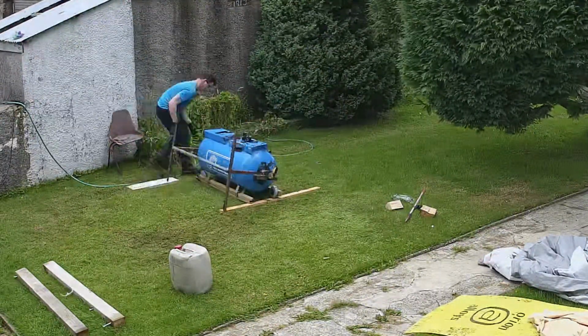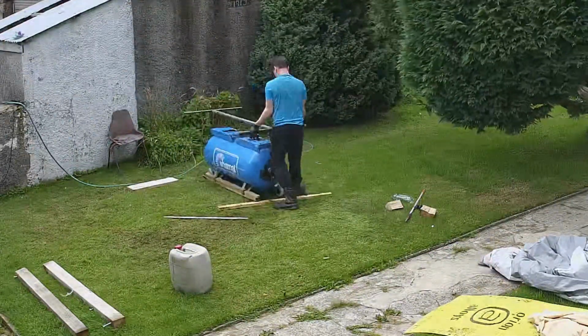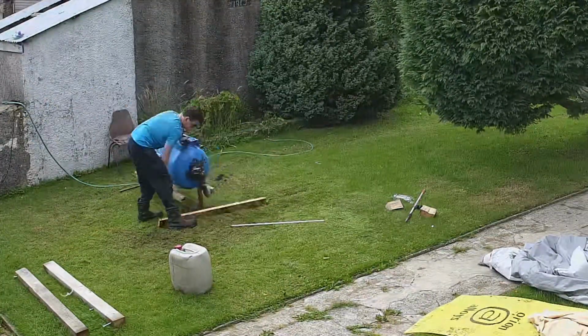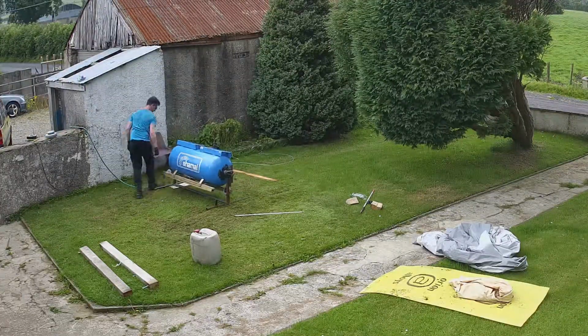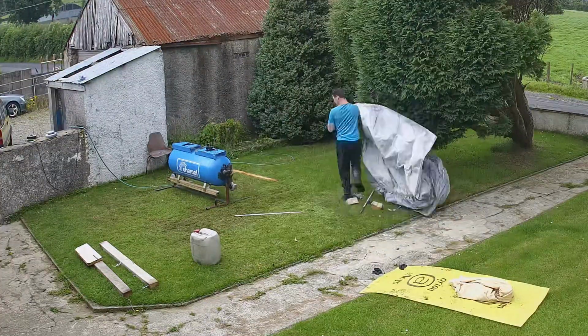Once the oil had evaporated off the inner face of the vessel with the help of a hairdryer, a hoover was then used to get the final pieces of media out through the 2-inch port. A rag tied to a stainless rod was used to speed this process up for the next treatment stage.